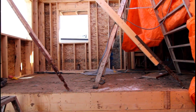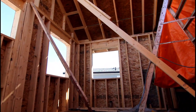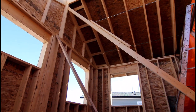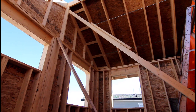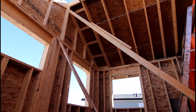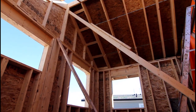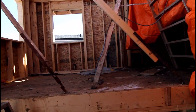Another use for turnbuckles: you can see the one on the left keeps our wall straight and nice and plumb, and the one on the right — or the top half — keeps the gable nice and plumb and straight so they're not pivoting on each other. Once we get all our ceiling joists and rafters in place and sheeted, then she's solid and those can be removed.